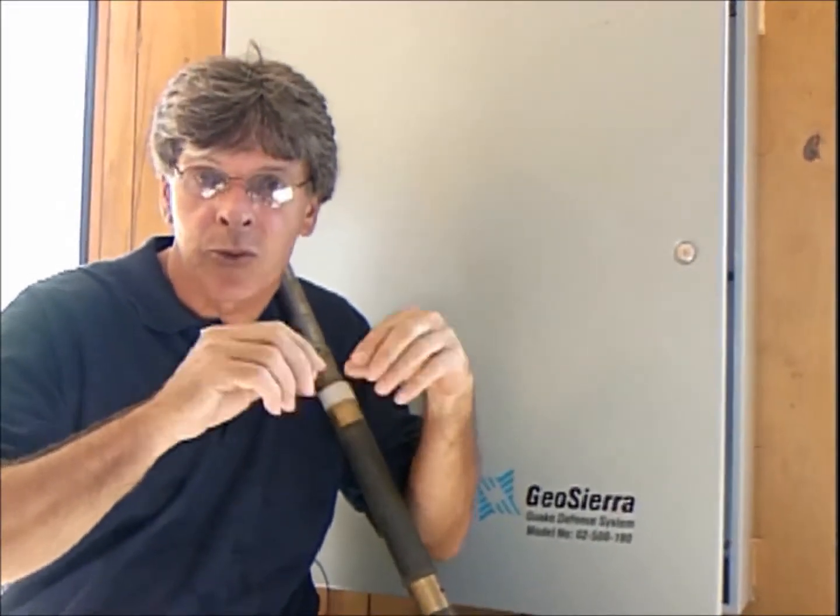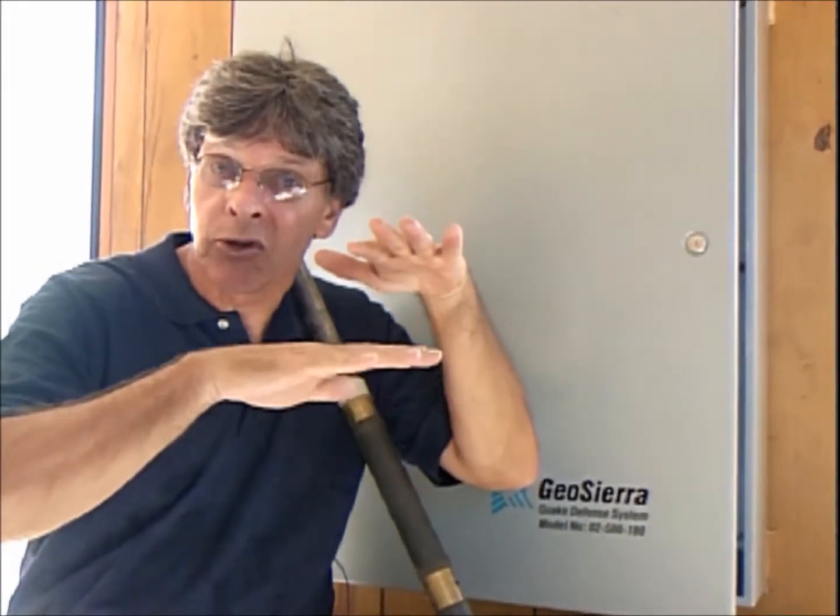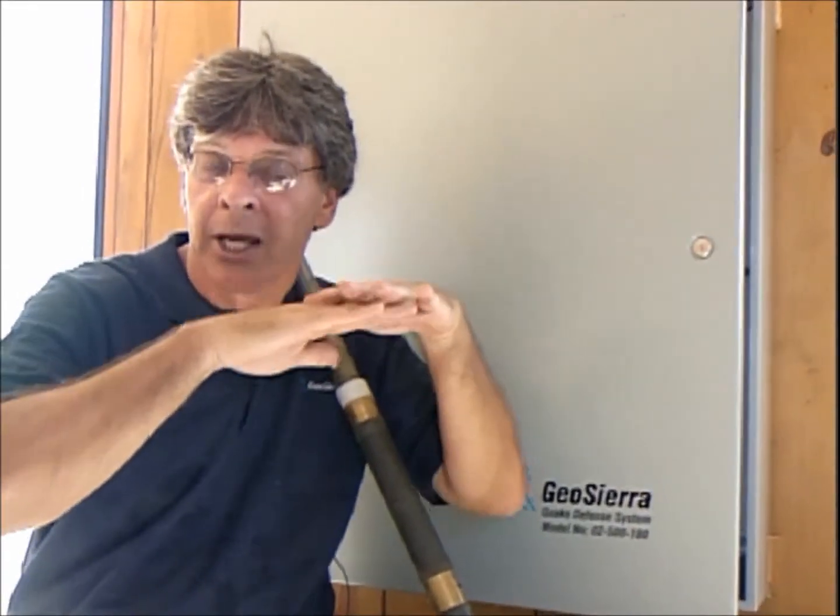Basically what happens is the earthquake happens and it sends out a pressure wave first, which has no energy, and you'll receive that early and you won't be able to feel it. And then along comes, at a later time, the shear wave, which will come along through the bedrock, and then it will propagate upwards through your soils into your foundation. Now, it's that upward propagating shear wave that basically shakes and loosens the sand.